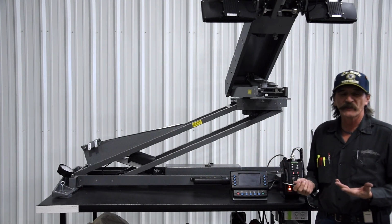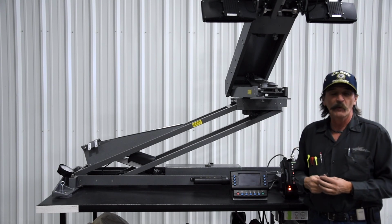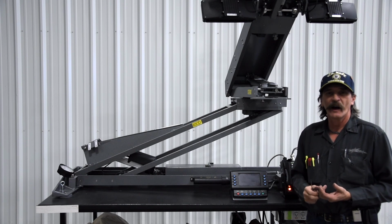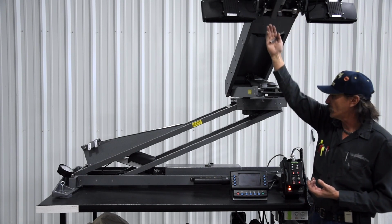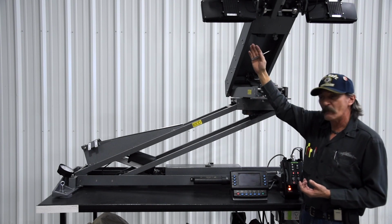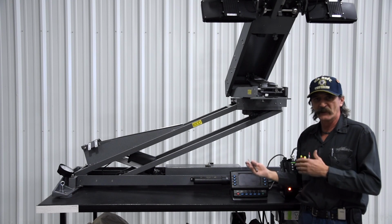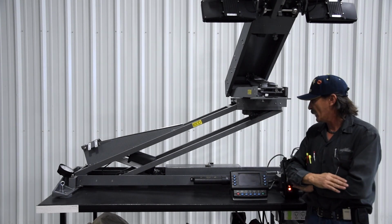The complete auto park sequence on a command light, which is what model we have here, would be as soon as you activate auto park, it will look for center. Backlights will flush up with the other four lamps. Once it's found its center, the backlights are flushed. Lower stage will come down till it activates the down limit sensor. Then the upper tree will come down until the light is fully nested.